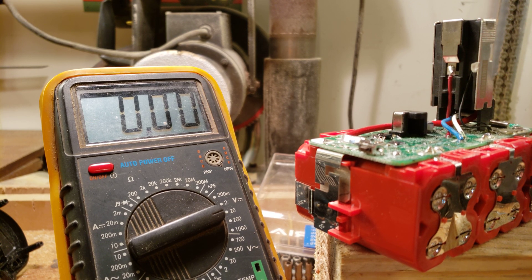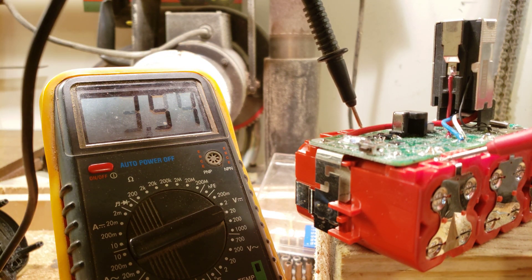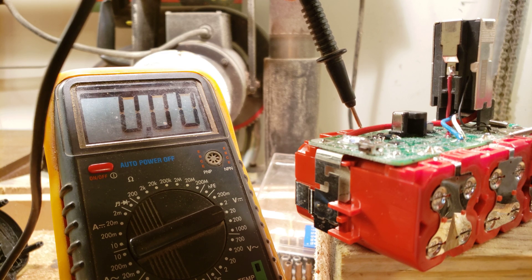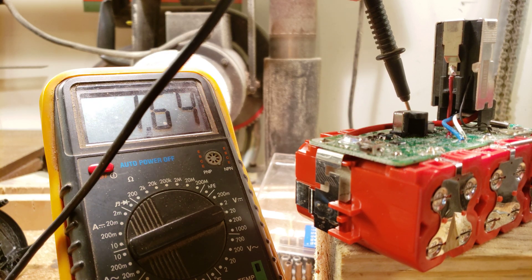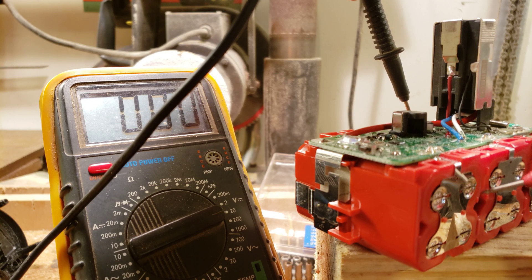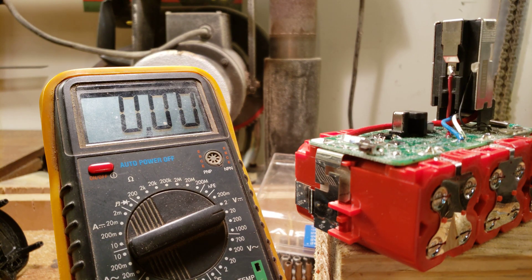We can see on this side and on here, we read about 3.9 volts, and the same occurs up here — this cluster that I wired in series, you can see the split. Both are reading 3.9 volts, so I figured the batteries aren't charging somewhere.